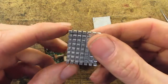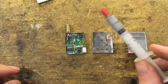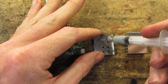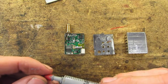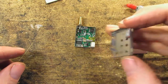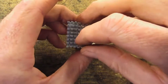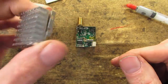So I've cut this bit of heat sink — probably a bit of overkill — but the plan is I'm just going to put it all together like this. I've got here some heat sink compound, and I'm just going to dab a little bit on there — that's probably far too much. Dab a little bit on there, squeeze that together, and I'll know that's making plenty of contact. I'll get rid of a bit of the excess, then put more heat sink compound on the back of this heat sink and stick that on there. Then I'm just going to use some high temperature string to lash the whole lot together and hold it nice and tight.